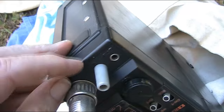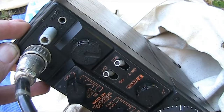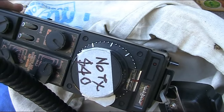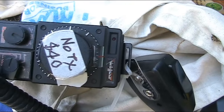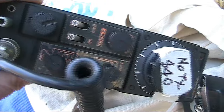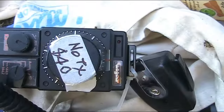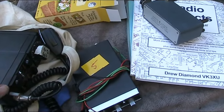This one has a telescopic antenna and a position for a shoulder strap, so you could operate two-meter SSB pedestrian mobile — something that was a novelty at the time. Now of course you've got the FT-817, which is about half the size and weight and does way more bands, but these reputedly had very good RF performance. The ICOM IC-202 — and there are other models like the ICOM 502 and I think a 70-centimeter version as well.